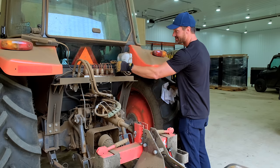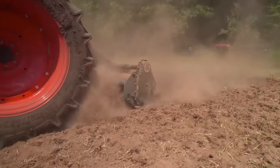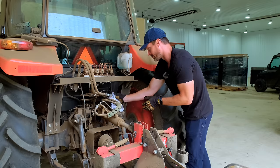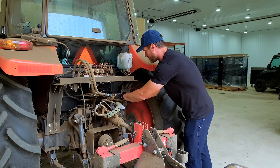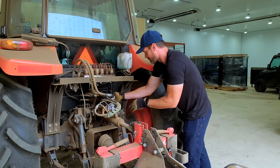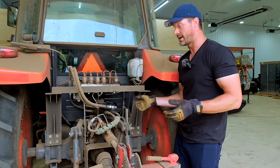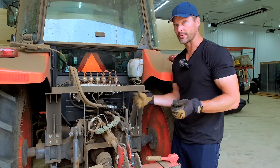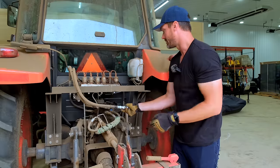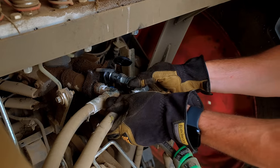Here is a good example of why you want dust covers. It is like the dust bowl around here lately — this tractor was doing some tilling and it's absolutely disgusting. I want to show you this last type of hydraulic coupler on the back of a Kubota. I don't know what it's called and I don't know anybody else that has this style, but I think it's super cool. You don't have to pull back on any collar, and it's not a flat face — it's still some sort of pioneer or ag style coupler. You just yank them out and push them back in; there's no collar of any kind. I don't know the sorcery behind it, but I like it. And then you can slap a dust cover right down on it — really nice. Pop it back open and you're back in place.